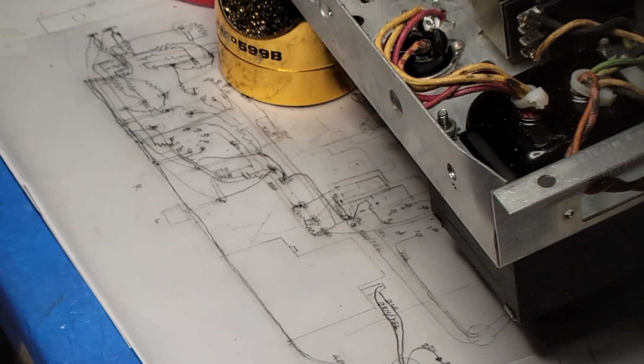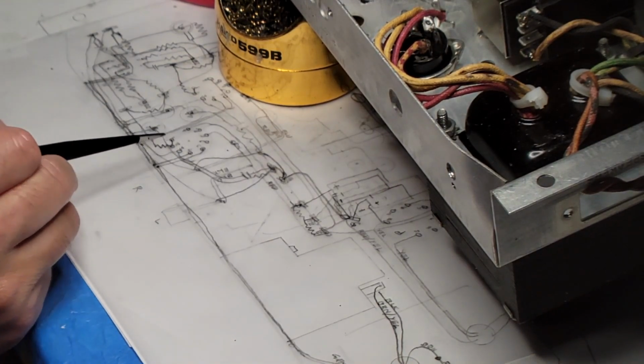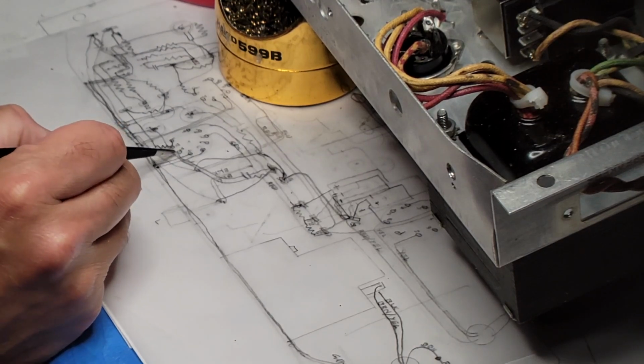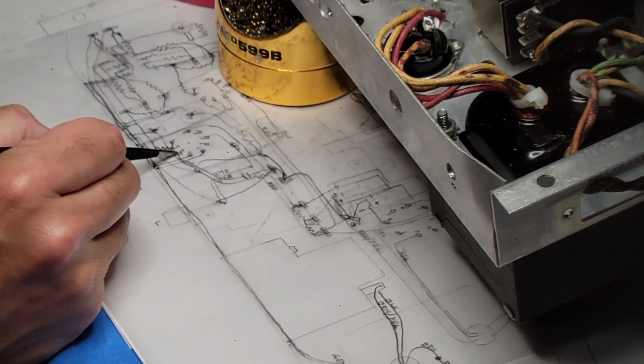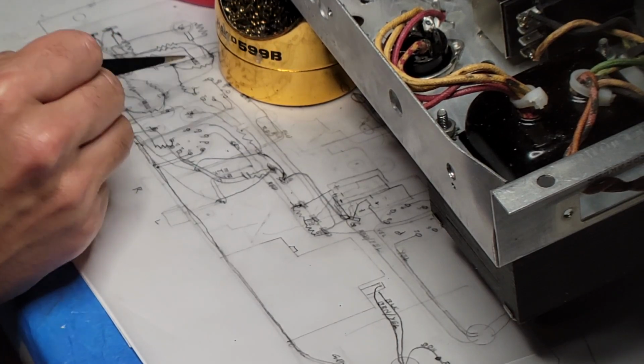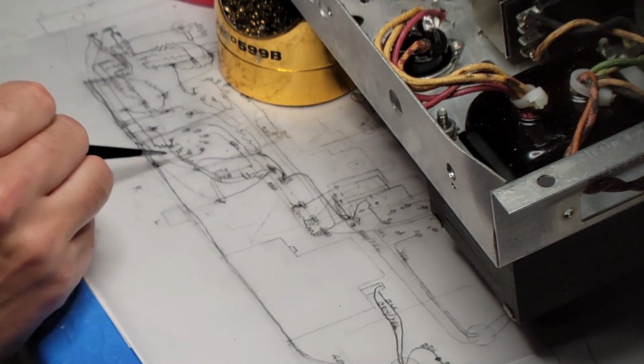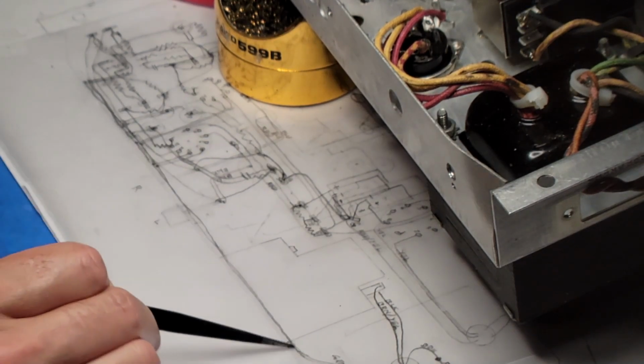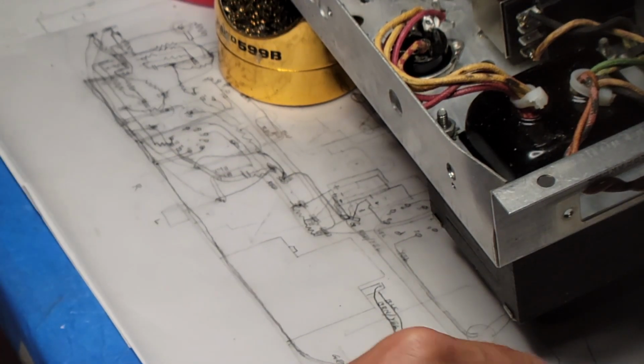I just realized that I left something off of my drawing. Specifically, I need resistors from pins 4 and 5 to pin 3 of one of the output pentodes. It would probably be best to do it on this first one, since it's the first split off of the main line. I'll draw that in right now.